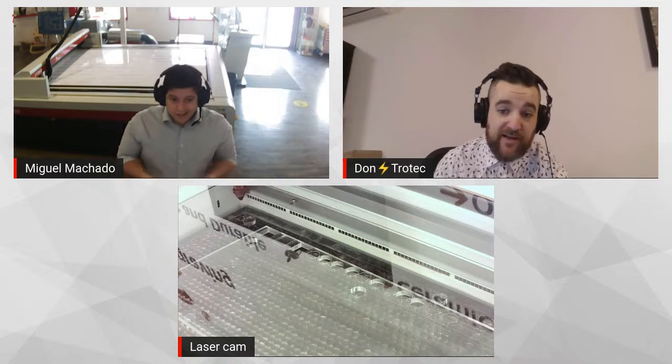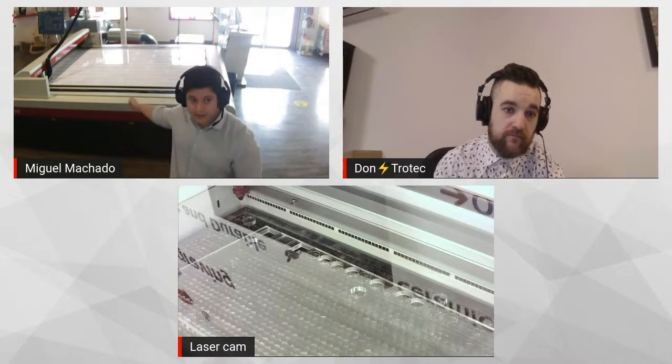So people are asking that exact question, Miguel. What about a 4-inch lens? So 4-inch lenses are not, at least on a Speedy, really made for cutting, right? They're too far from the focus point. The Speedies don't have enough power as an SP. So it would be too far off, and the dot size is going to be too big. You're going to lose a lot of power.